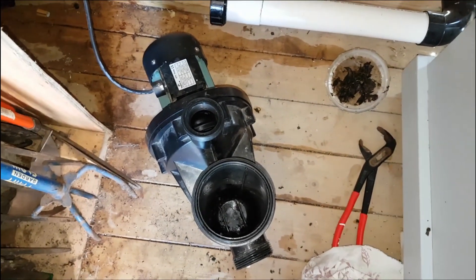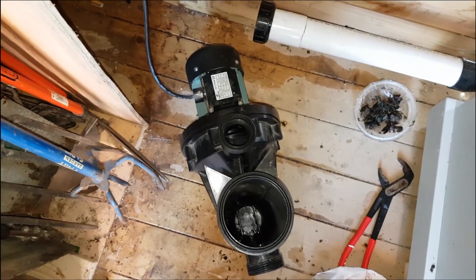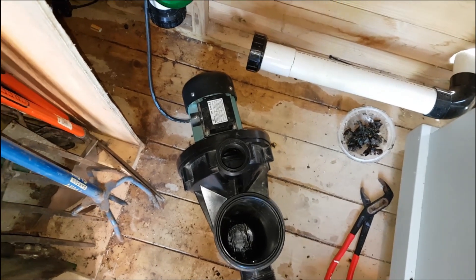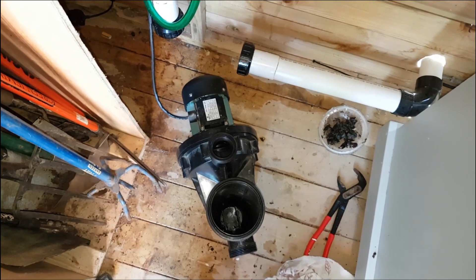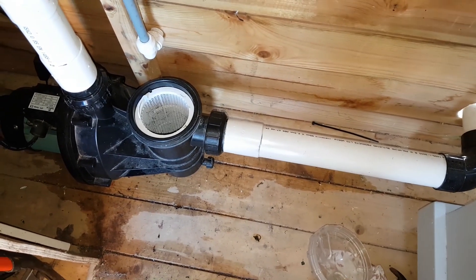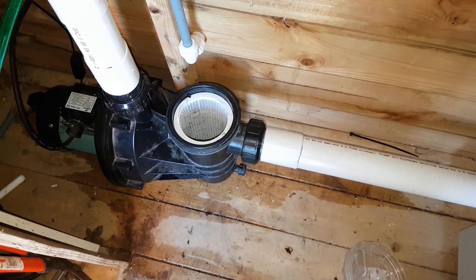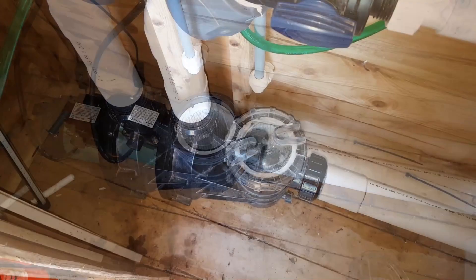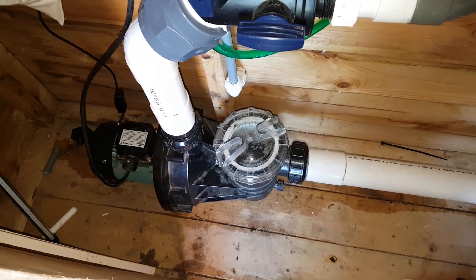It's all back together. I'm just going to give it a quick spin to make sure it spins okay before I connect it all back up. Sounds good! Now we've just got to hope it doesn't leak. It's back in place — all I've got to do now is prime it, turn the tap off outside, fill it up with water, put the top back on, and let's hope everything's okay. All back in and running — let's go have a look at the flow at the pond.